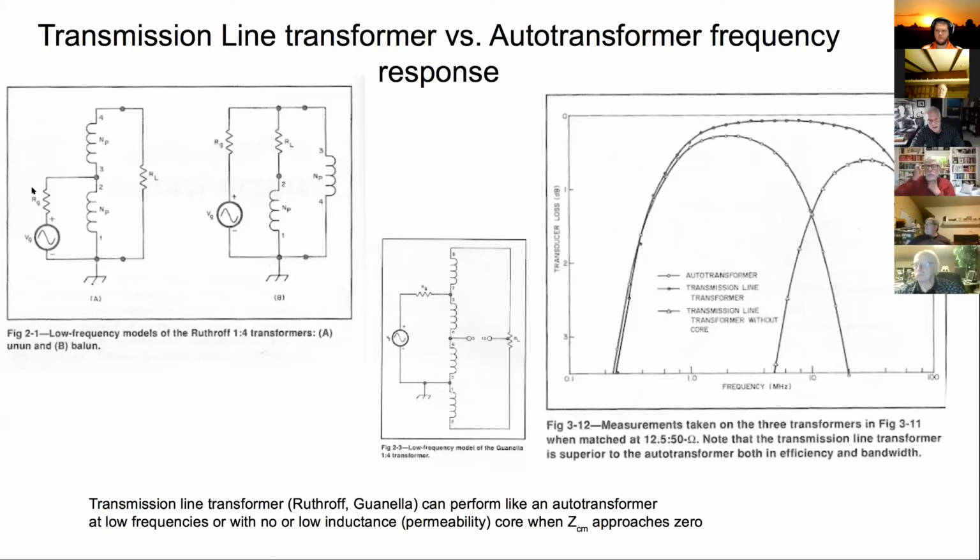And what's the difference? The difference is that you're not using, say, a bifilar type of winding, or a coax. You're just using a single wire wrapped around a toroid, and then the other wire is wrapped around maybe the other side of the toroid, and then you get just a simple transformer. It may work as a choke, but it's not going to have the frequency range that maybe you're looking for, so you want to try to avoid those.